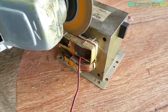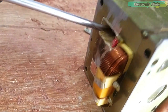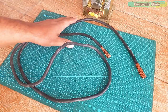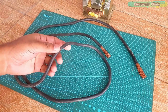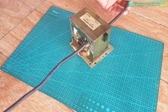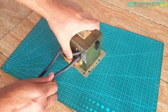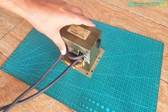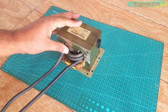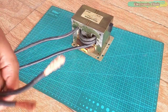While cutting the secondary winding, be very careful and don't cut the primary winding, otherwise your transformer will be just useless. The secondary winding is removed. Next, I'm going to use this 16mm wire which is 6 feet long as the secondary winding. You can see two turns on one side and three turns on the other side — the basic setup is completed.